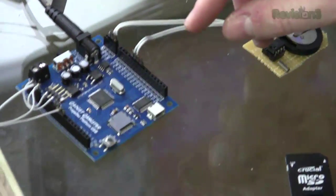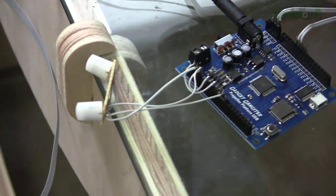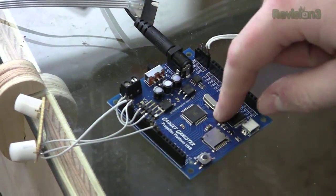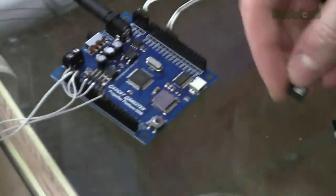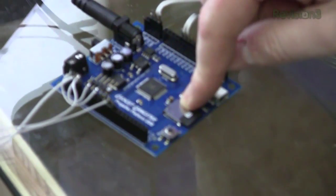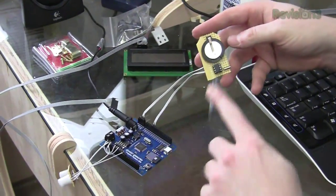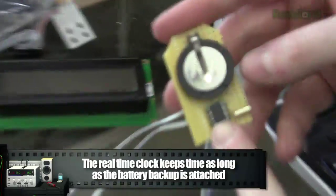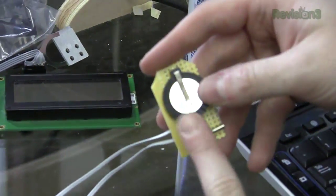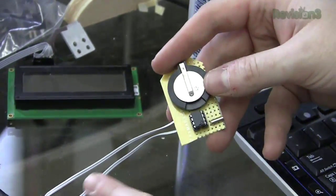Here's the system we're going to use to analyze what the hand sanitizer is doing. We've got two motion sensors, and when they detect motion, you get positive voltage on the line. It's hooked up to a Parallax Propeller Development Board made by the Gadget Gangster, which has a little slot for a microSD card. The microSD card is where we'll store our data logging and play audio clips such as 'please wash your hands.' Over here we have an RTC — a real-time clock — with a crystal and battery backup, so even if power fails, the time is kept. It's an I2C device, so you can access it with just two wires.